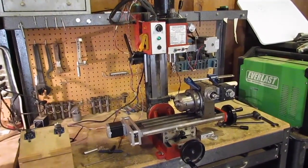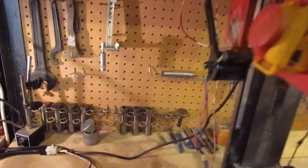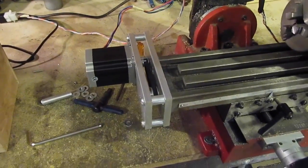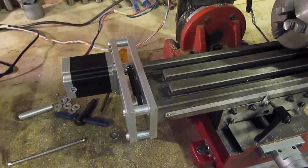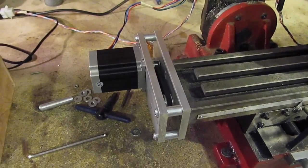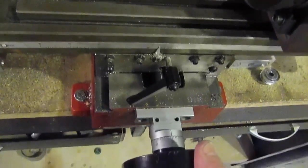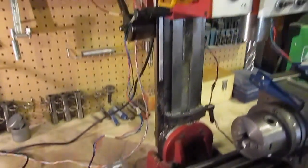So what I've been doing is a CNC conversion on the cheap — adding these stepper motors that turn the cranks very accurately. Instead of just getting electricity and spinning around, they get pulses of electricity and turn just one step at a time for each pulse. One revolution of the motor is 400 pulses, so you can get really accurate on where it turns, and I can move these dials right to exactly the right measurement every time.